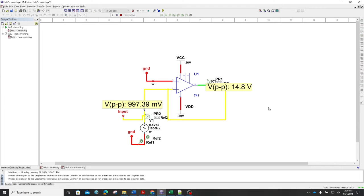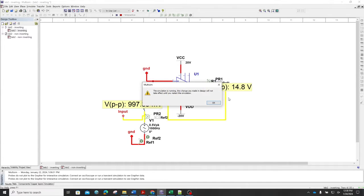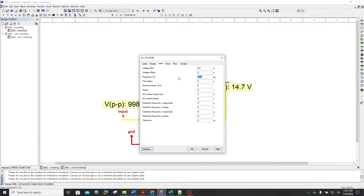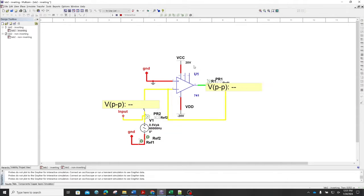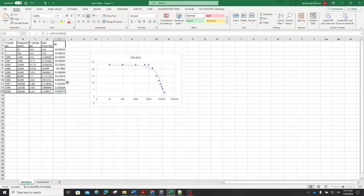In interactive mode I can run my simulation and see my voltage output and voltage input. If I change my values — let's go to 5,000 Hz, stop and run it again — the value changes ever so slightly. As I go through different frequencies, for example 60,000 Hz, I observe different voltage outputs. In this case I'm just looking at magnitude, not recording phase.